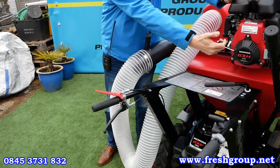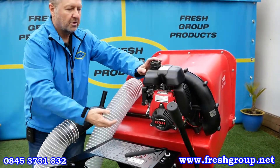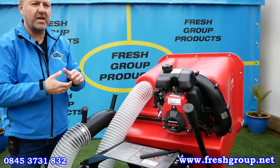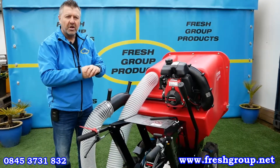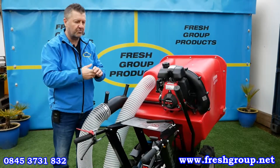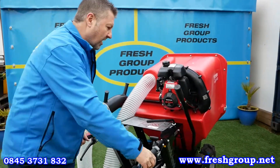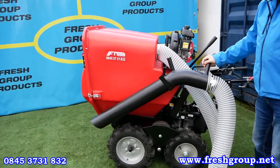When starting, the correct stance is feet this way and use your hand as an anchor — take up the biting point and give a firm pull. I'm just going to switch the choke off. It's a cold morning, so you want to run the engine for three, four, or five minutes to let it warm up. If you put it onto full power when it's cold, it's likely to die on you and you'll need to restart it. I'll just let that run for a bit.